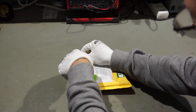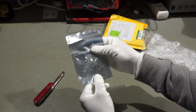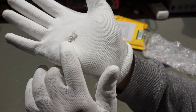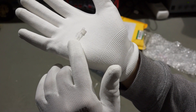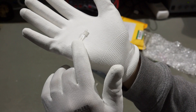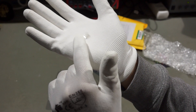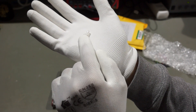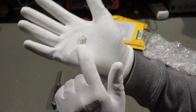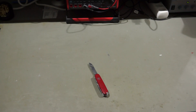Next one from China. These are LEDs, but not normal LEDs. These LEDs have four different pins, and you might remember an episode where I used these kind of LEDs. They behave like NeoPixels, but this time they are not eight millimeters in diameter — they are only five millimeters in diameter. So these fit into many applications where you want to have different colors but only one LED. You can use them with a normal NeoPixel library.